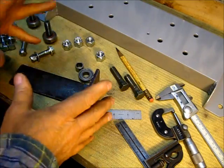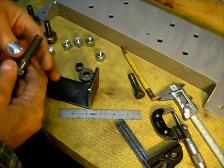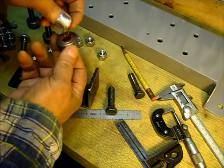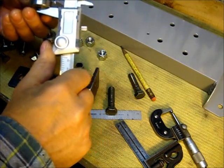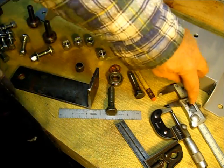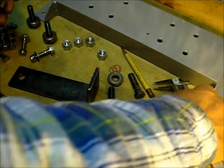The next thing was: how did I know where to cut? What I did is I took the bearing, put the washer there, put the other washer on top, got the dial indicator, and it measured out 491 thousandths. Keeping that in mind, I sawed off a piece of tubing at 500 thousandths — that's close enough.